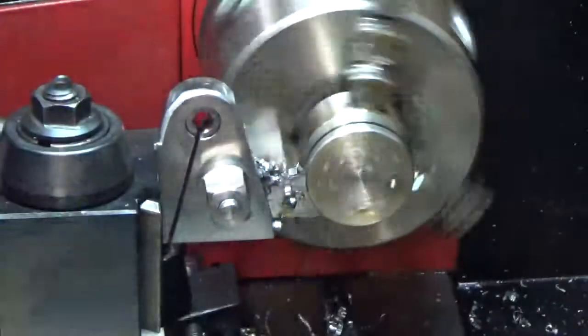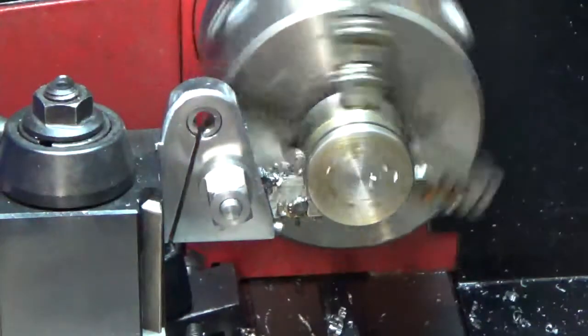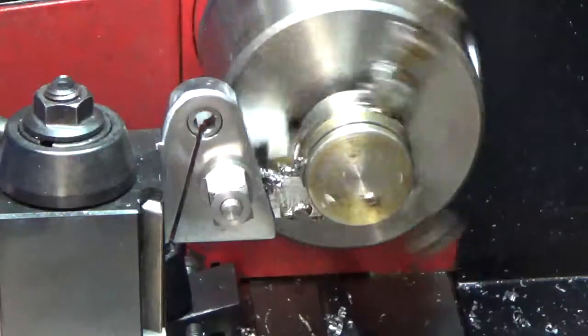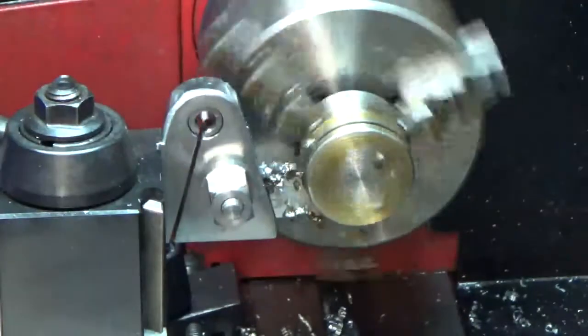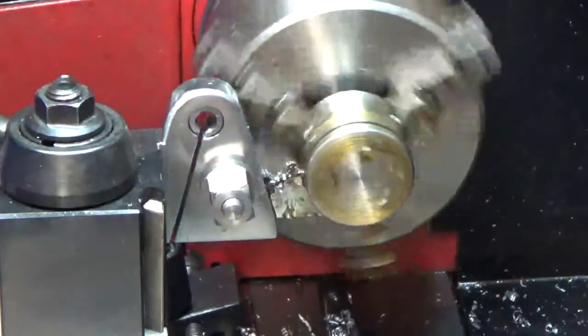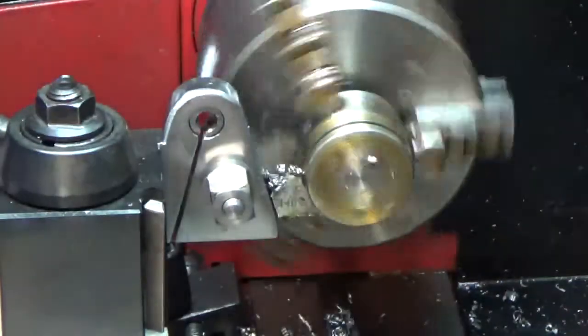This holder is like night and day — there's no comparison, I'll never go back to the other holder again. These spring holders work; they're a little trouble to build, especially for this size lathe. You can find an Armstrong holder for a bigger lathe, but not for this one — although Armstrong used to make one about the right size for a small lathe, probably made for like a 9x20 or something. I could get more aggressive if I wanted to, but this is going long, so I'll just let it go.